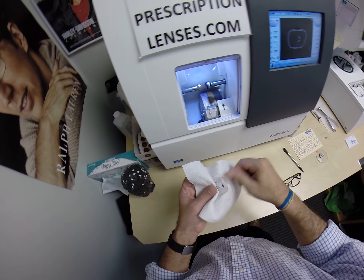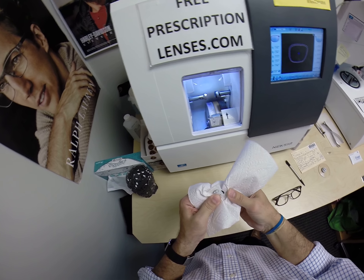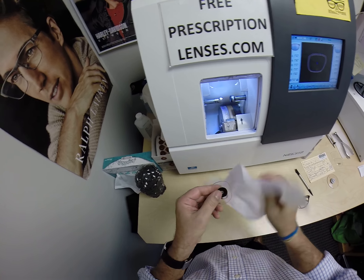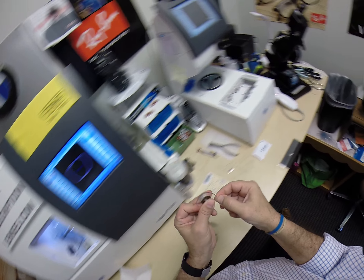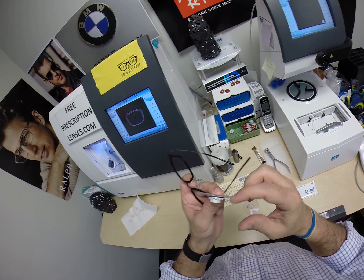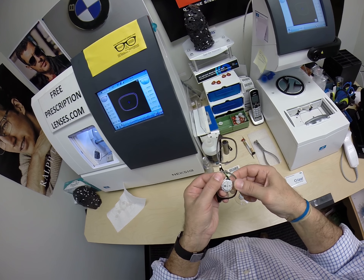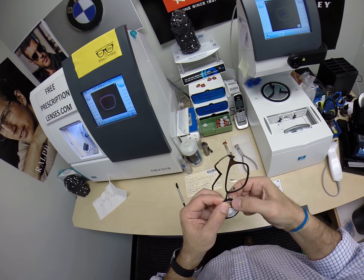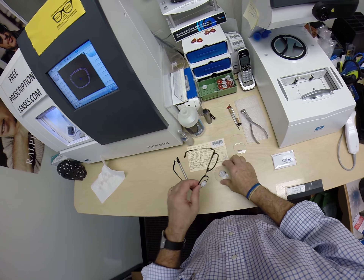Let me open the chuck up. Hey, chuck. Thank you, chuck. Dry everything off, clean some things off there — a little bit of optical sawdust. Take it down here, throw that in the trash. The reason why I put a safety bevel on the back surface of the lens is because I'm now going to push the lens into the frame — I don't want any rough edges from the lenses to come in contact with your frame, and it snaps in there easily.